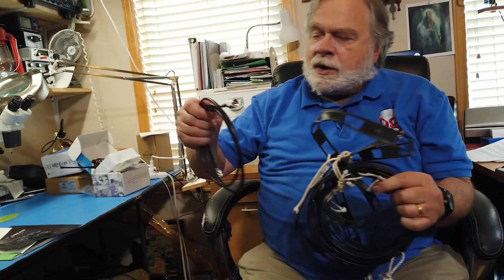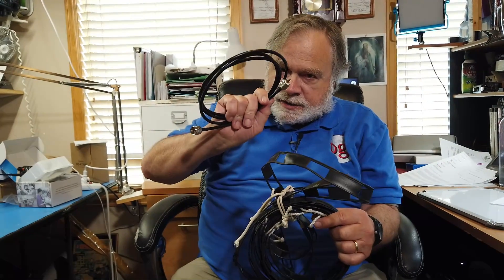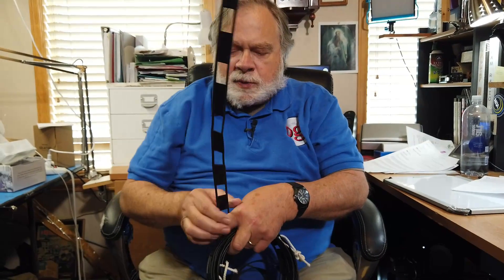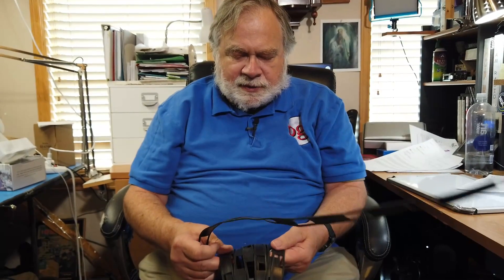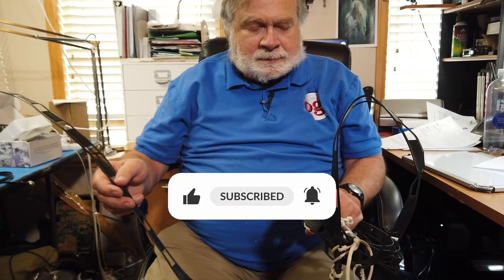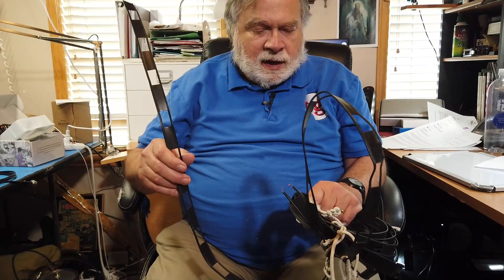However, this is not good to place on the ground, and it can't be coiled up. Unlike coax, where the energy is contained inside the cable, in ladder line the actual energy travels in an RF field around and between the conductors. If you coil it up, those RF fields will interfere with each other and you'll get unpredictable results. As for forbidden lengths, we'll get into that a little later because those also affect coax — and if you have good matches, they don't affect anything.